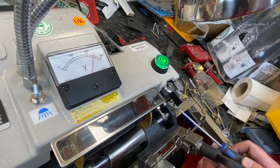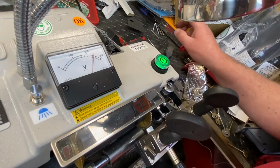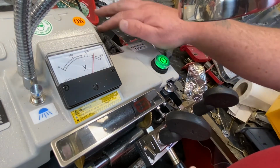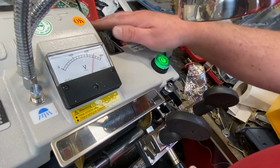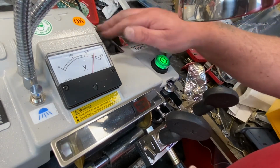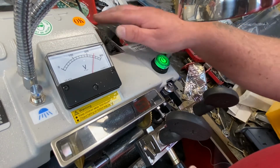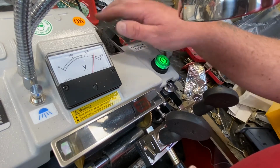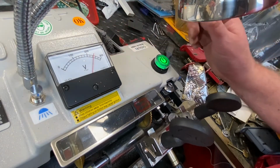It was the other way. We're sticking far too much out. Try that. So do that. It wasn't enough, not set the same as the other side, so it wasn't cutting properly. So you need to be able to just kiss off, well, it sounds a bit of a weird word to say, the actual chrome. You've got to get that set so it's actually slightly just kissing into the chrome.